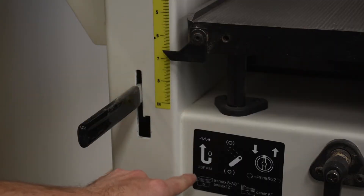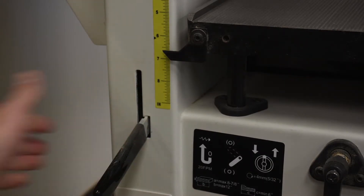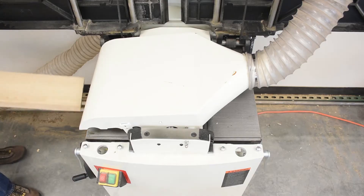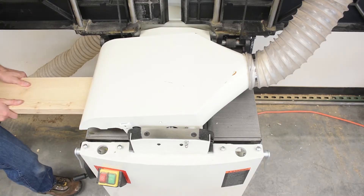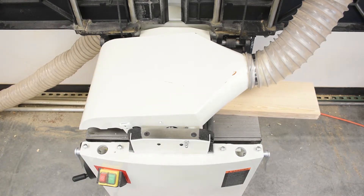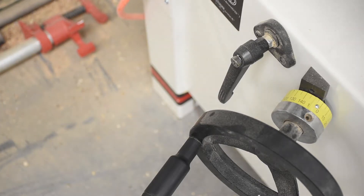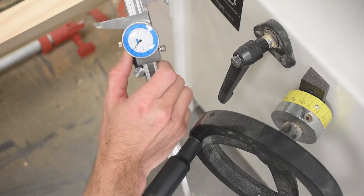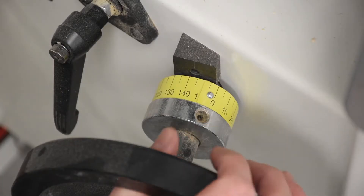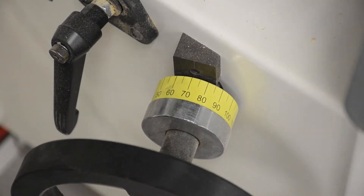This lever here engages the power feed, and it's almost always engaged. Pulling it down and over here disengages it, but I've never had a reason to disengage it because I'm lazy. So I'll turn it on and send it through. Now, just like the joiner, I'm listening to the sound and watching the outfeed to see how it's going. I'm going to plane this down to an inch thick, so I'll run it through a couple more times, an eighth of an inch at a time. Now for this last eighth inch, I'm going to measure it before I get to my inch because I want it to be perfect. So you can see that I'm pretty close here. So now I'm going to do some math and switch to using the hand wheel markings to take off exactly the right amount.